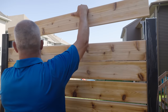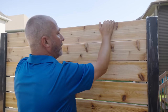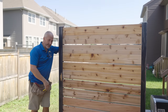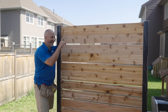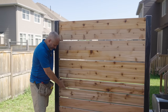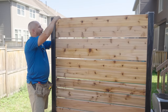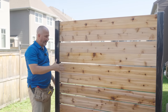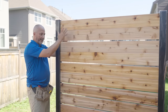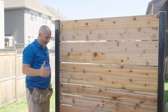That's still not going to fit. Oh. Still doesn't fit. Okay, so it's unanimous. One vote and I made it. Alternating spaces of 5.5-inch deck boards with a 1/2-inch space leaves me with this little bit of height left over. I'm not sure what everybody's thinking, but I'm just going with double spacer. Going to do it consistently across the board. That allows me to put my decorative cap on. To me, it's a win.